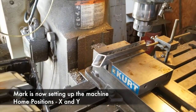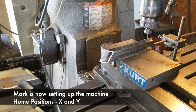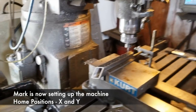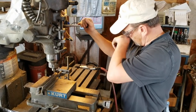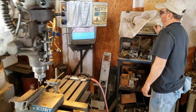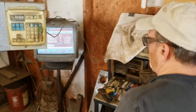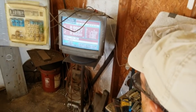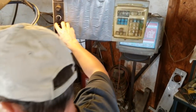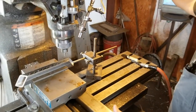So that's your jog right there. Is this the line closer now? Yeah. That's as good a starting point as any. So zero X right there. What's your distance on Y? Or is it critical, or just center of that? Center of it — it's not critical.